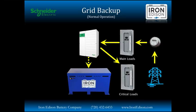In this example, all of our power will be coming from the grid, first powering our main loads. Then the XW Plus is going to use the grid power that it needs to power our critical loads as well as maintaining the battery. While it's doing all that, it's also going to be monitoring that grid power, not just the fact that it's there, but the quality of it. We can define a window of what's acceptable voltage and acceptable frequency from the grid.